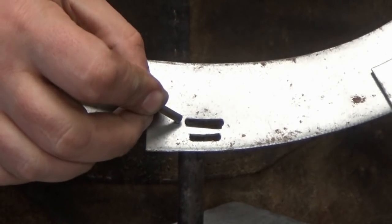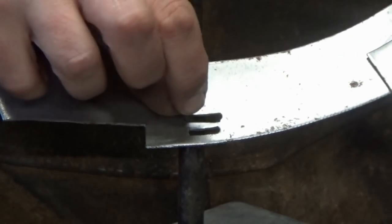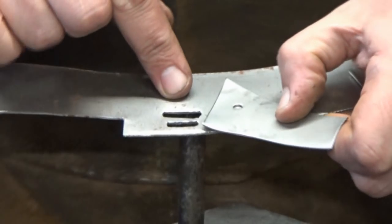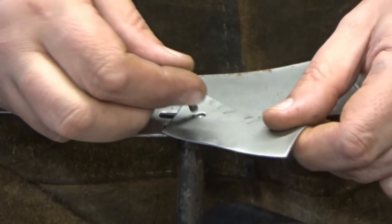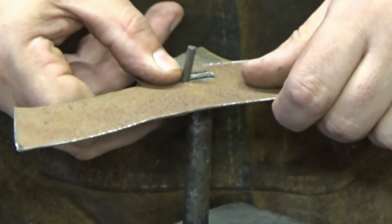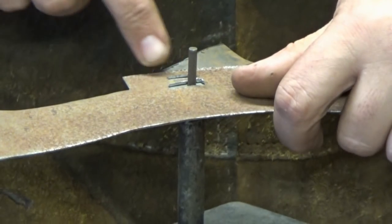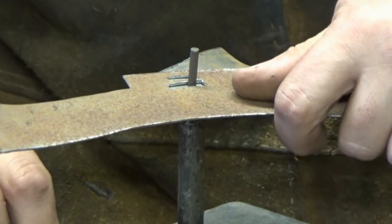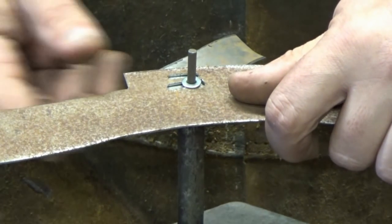So we've got the slots — I'm going to use the slightly larger one at the top here, but they both work as we've seen. You'll see these principally in articulations — in elbows, knees, pauldrons. All you do is put the rivet through both pieces and just check there's no binding. Now on the other side you need a washer; you can do it without but I wouldn't recommend it — it will break through sooner or later. I haven't seen yet an original with the original rivets in place that doesn't have quite substantial washers. Very often the small engineering ones are dangerously close to the size of the hole, so often make these yourself very easily.